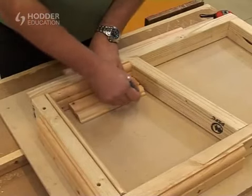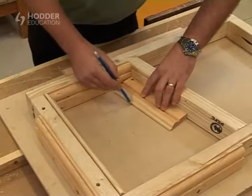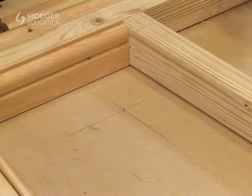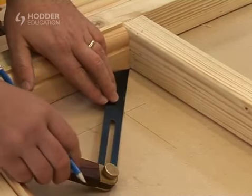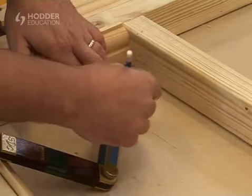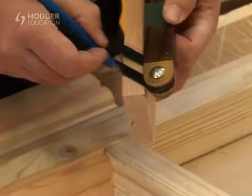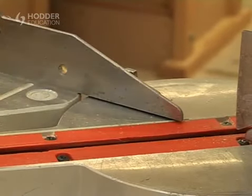Use an offcut of skirting to mark its width on the floor below both wall surfaces. Mark a pencil line between the intersecting lines on the floor and the corner of the wall. Adjust a sliding bevel to the line of the bisected angle and transfer it onto the top and bottom edges of the skirting. Adjust the chop saw to the same angle as the sliding bevel and cut an internal mitre on the adjoining piece of skirting.